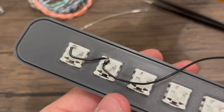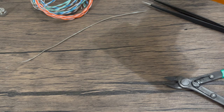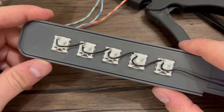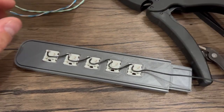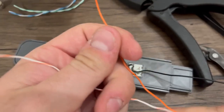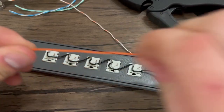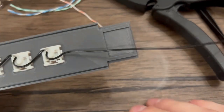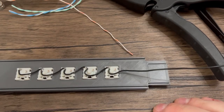Thankfully there is a good joint there. Now that that is done, we're going to take individual wires. This is just a Cat5 cable that I've torn up and cannibalized some wires from — they are the right diameter for this kind of work. All I'm going to do is take these and solder them to these pins to get them ready to connect to the DB9 connector down here. I'll come back here in a second when I'm done with that.